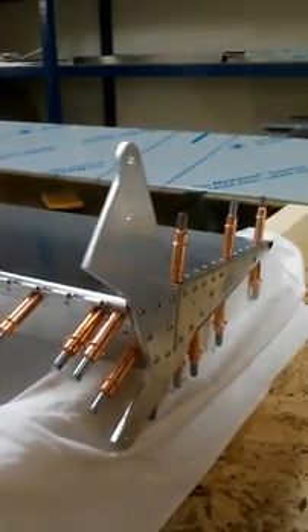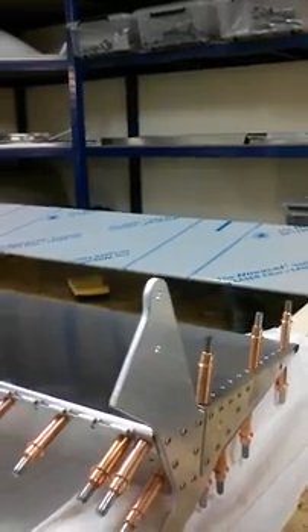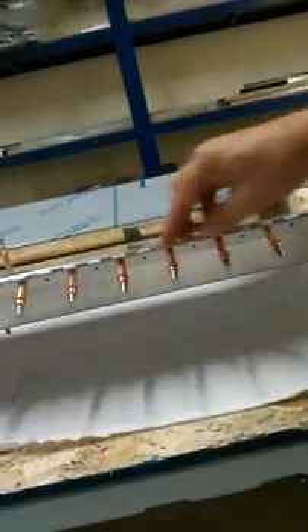On this particular piece none of the holes were, so you had to basically start off with a section of metal like this — this is one of the ailerons which I've got to do next, it's just a hollow tube of folded sheet. We had to make the drive horn assembly, which is this part here — that's made out of four different parts which had to be drilled and finished off, then riveted together. The bottom end of the rudder had to be cut at a rather peculiar angle and then fitted around the drive horn so it's a nice snug fit.